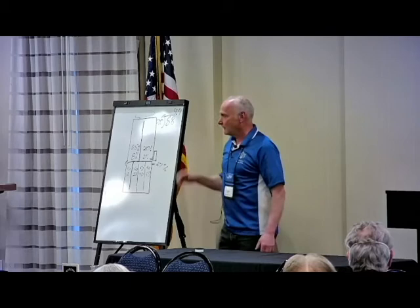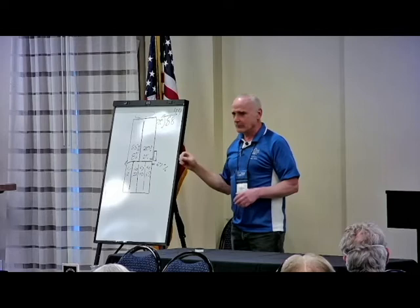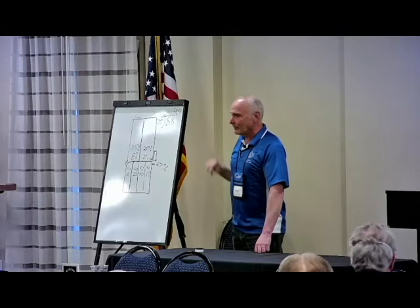And so the construction of this firebox is really important. The nozzle that you use on your oil burner is really important. You want the flame that the manufacturer of this machine intended for you to use. So contact the manufacturer and find out what nozzle they recommend for this particular machine that you have.